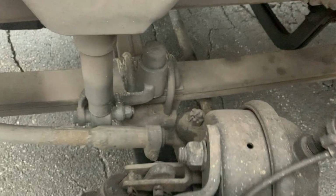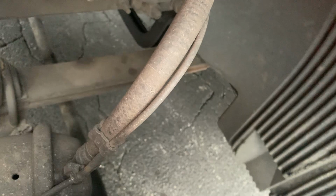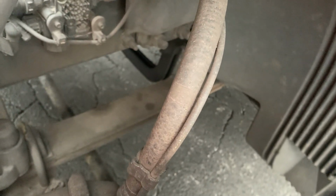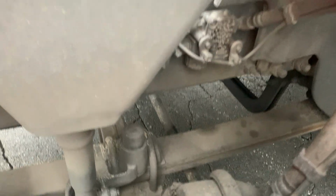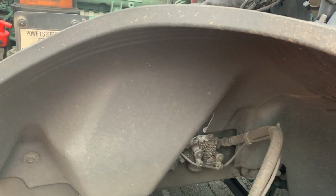The brake inspection consists of two parts. I would check the hoses are security mounted, not cracked, frayed, or leaking. I would check all around the brake system, make sure there's no contaminants such as fluids or oil on the brake system that can affect braking performance.